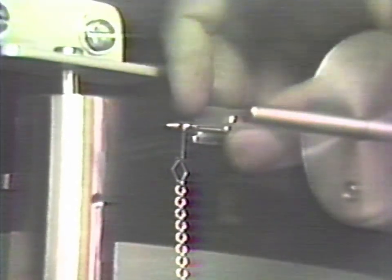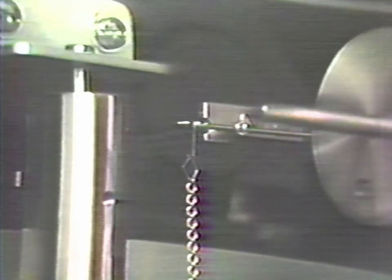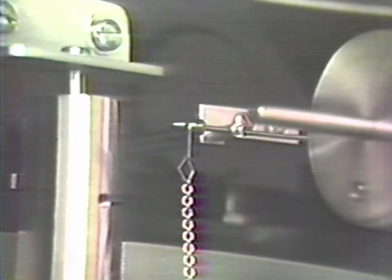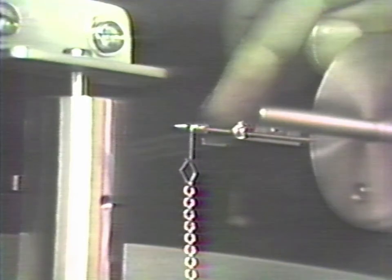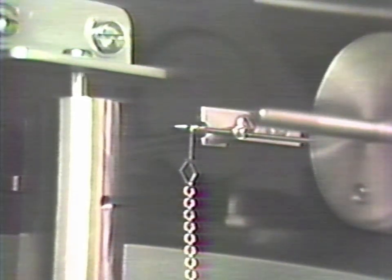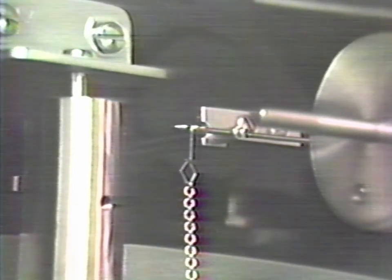And then rotating the spear, in this case, rotating it so that it moves slightly closer to the center knife, tightening the lock screw, and then retesting. However, the adjustment of this bearing, because it has a weight hanging from it, is also going to cause a change in the zero point, so it will be necessary to re-zero the balance before rechecking the calibration.